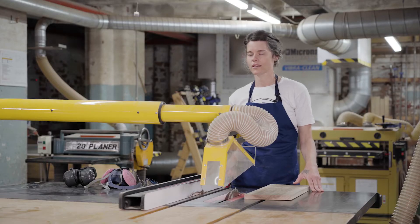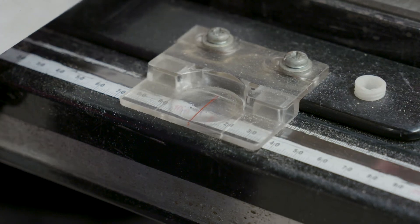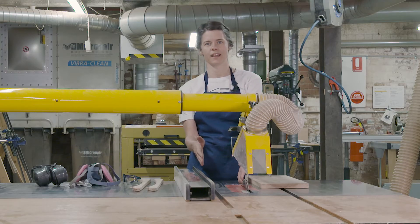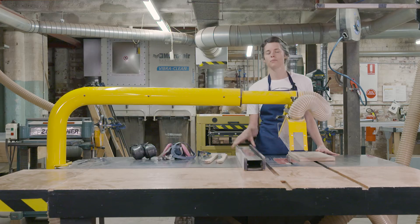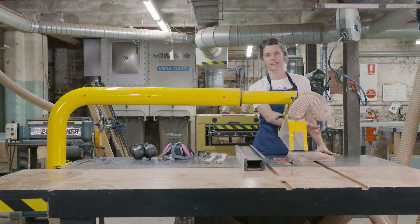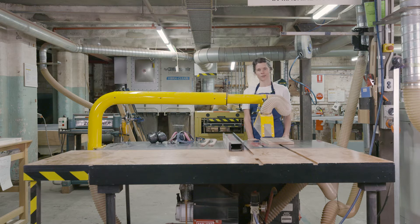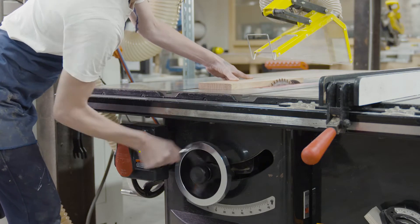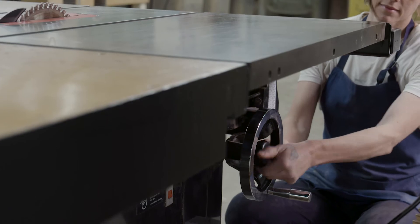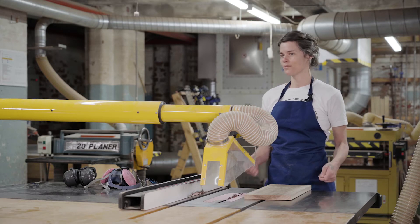You always use the SawStop with a fence. It can be slid sideways, and you'll notice a gauge here that will tell you how wide the space is between the blade and the fence. Make sure it's locked into place before you run your piece through. The fence can be moved to the other side of the blade if you need to cut on that side, but remember to consult your tutor first. You can raise and lower the blade and tilt it to get your desired cut. To raise and lower it, rotate the wheel on your right. To tilt it, rotate the wheel on your left. Both of these feature locks, so make sure they are unlocked before you try to move them.